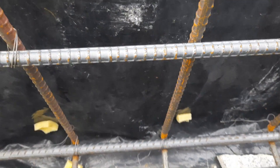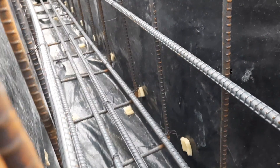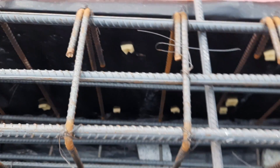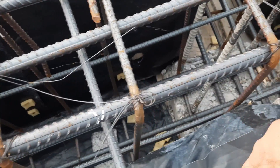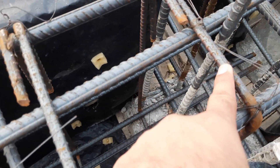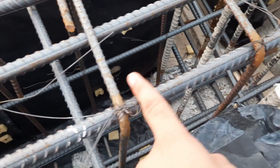The side bars are provided at the distance of only L/4, not fully. Four bars at the bottom — diameter is 16 millimeters. Stirrup diameter is 10 millimeters with spacing of six inches at the distance of L/4. Three are provided at the top portion and four at the bottom. The first stirrup is placed at a minimum distance of two inches.